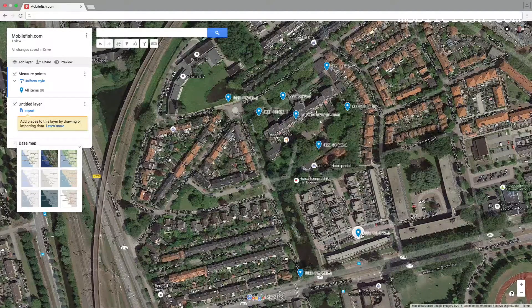When the node was at this location, the LoRa gateway is located on the second floor. At the first floor, the signal strength is minus 90. At the ground floor, the signal strength is minus 110. And in the basement, the signal strength is minus 117.